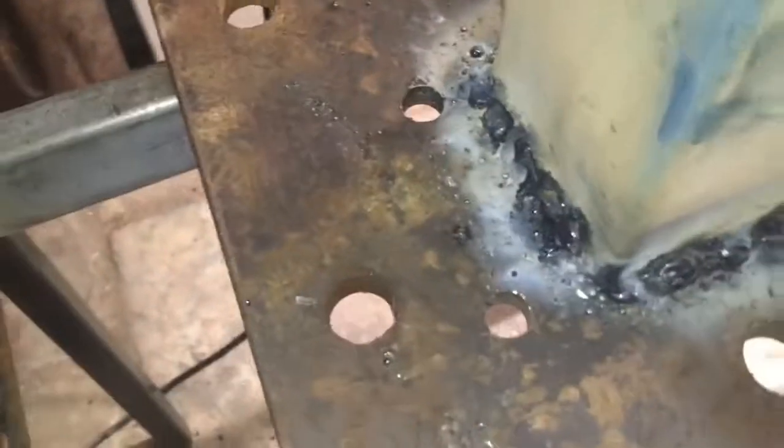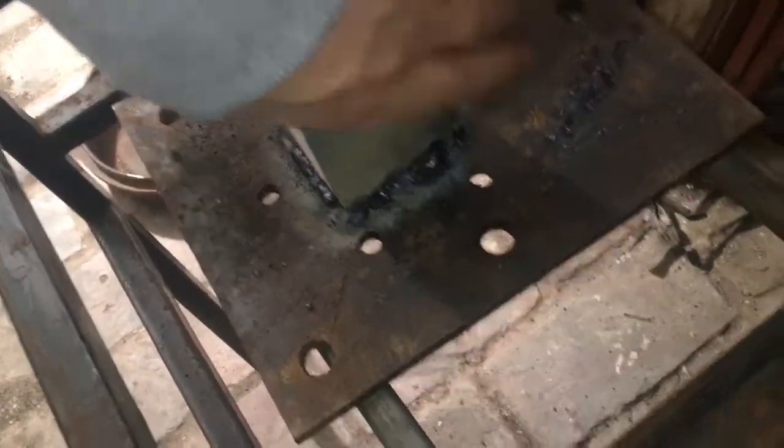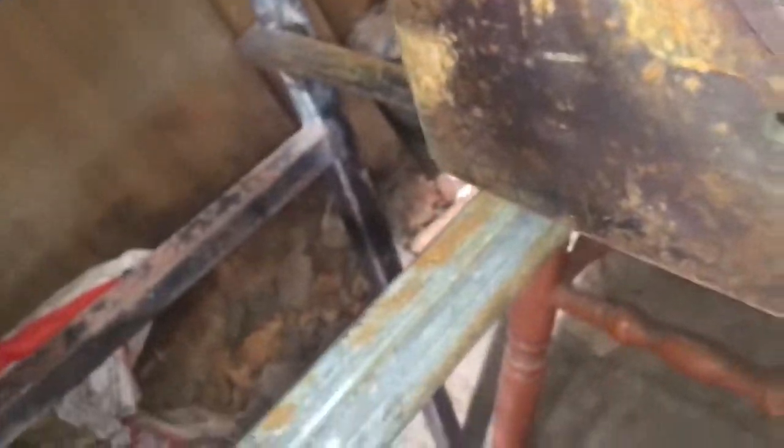So after a lot of back and forth, I'm going to call that done. Let's have a look at what it looks like. Got the light on — it looks even worse, it's pretty rough, still got slag on that I've got to knock off. But you get the idea — it's a pretty rough and ready sort of weld, but it is definitely on there. I was a little bit worried about it burning through, and looking from the inside it has actually started to burn through in a couple of little spots. You can see that little rough area — it hasn't come through, but it's got close. So that was pretty lucky.